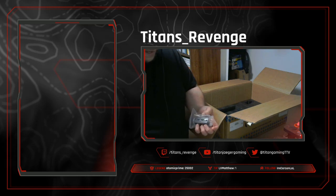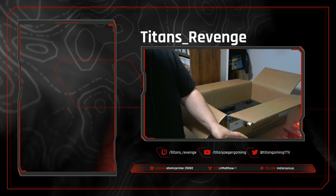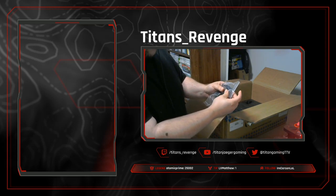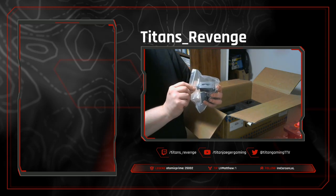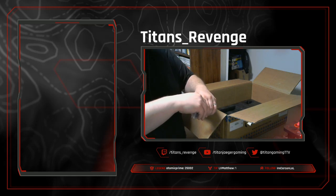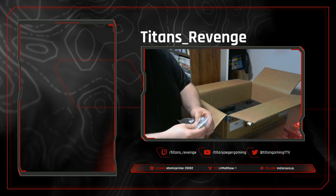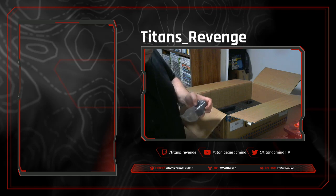So this right here is for the belt pulley system. One of the better things about this 3D printer is it does have the belt tensioning knobs on the outside, which means you can just screw or unscrew to get your belts tightened and loosened, where on some of the other machines you have to take pretty much that whole thing completely apart to readjust your belts. So it makes it super easy to just tighten and loosen your belts through that nut.